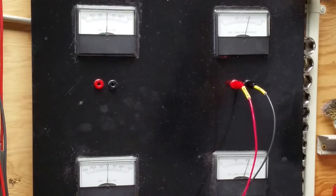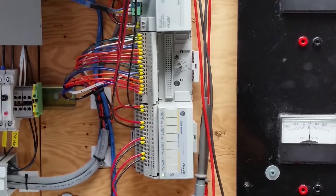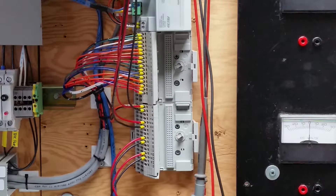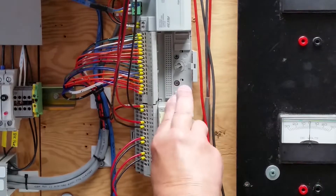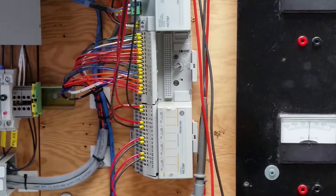Now with multiple modules to test, you want to do voltage or current test first — whichever you choose — and rather than swapping wires around, you just swap modules. So we'll go back to our module. As you can see it's powered up. Allen Bradley recommends you turn off 24 volts first, which is always a good idea with any module, but you don't always have to. We'll take our module that I tested earlier that I know has a problem, take the sticker off, and power back up.